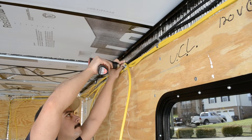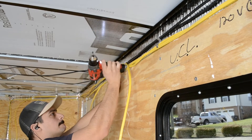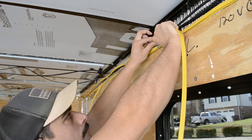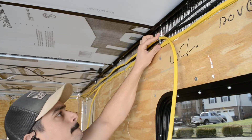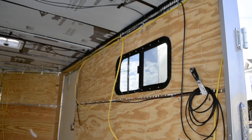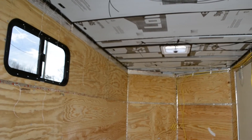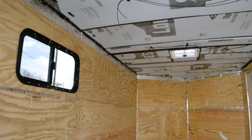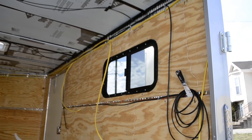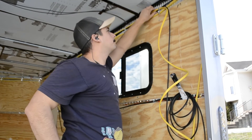There are three 12-gauge wires. Two of which are for 120V AC for when we're hooked up to shore power or a generator slash inverter when we have a battery bank. That third 12-gauge wire is actually for our 24-volt lines. We plan on running a 24-volt battery bank, and that 24-volt line will control our refrigerator and our water pump. The amp rating on the water pump and the fridge combined is about 10 amps peak, so we sized the wire according to that load at a certain distance, which is why we went with a 12-2 wire.